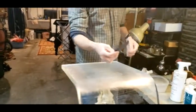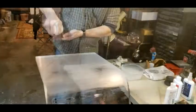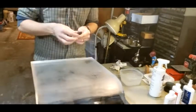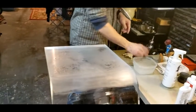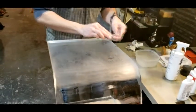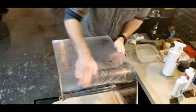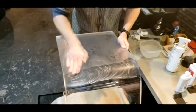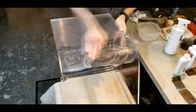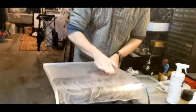Now we're moving to 1000 in a back-and-forth motion — this time going the other direction instead. Now we're on our last stage of sandpaper, the 2000 grit. The company is called Finish First — it's good stuff, lasts a long time, and doesn't break while it's wet. This furniture is 50 years old — these chairs are from the seventies. For the 2000 grit, I'm doing circular motions again. There's going to be scratches in a 50-year-old plastic chair, especially clear plastic. It's a lot easier to polish and remove scratches from plastic chairs that are not clear, so these are the hardest to deal with, but you will see how good this ends up looking.